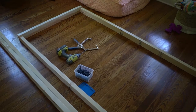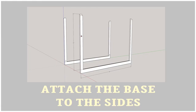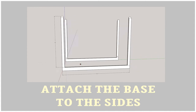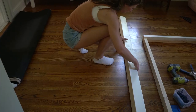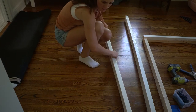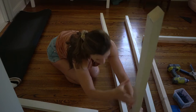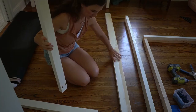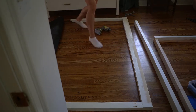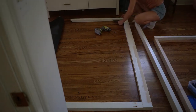I made the base, but I'm gonna put another plank in the middle later. The next step is to make the sides — for that, you simply take 2x4s and attach the poles to it. I'm making this bed a bit taller — I had to redo it, so the plan already shows you the taller version of this floor house bed. To attach it, I also used pocket holes, which makes this job so much easier.